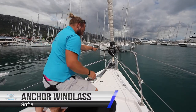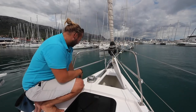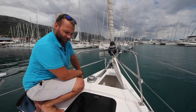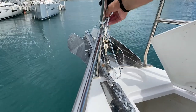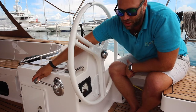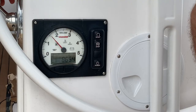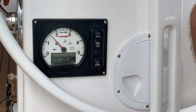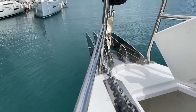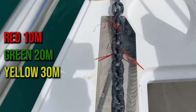When anchoring on board Sophia, open the anchor locker and secure it back. The controls here are down and up — you use these either with your foot or with your fingers. Remove the safety line from the anchor. When anchoring, make sure that your motor is in neutral at 1500 to 2000 revs. This will help with charging while you're running your anchor windlass. Push down to lower.